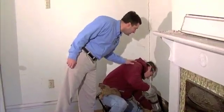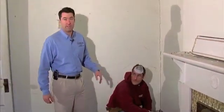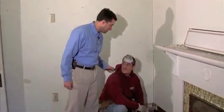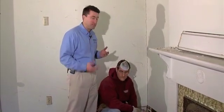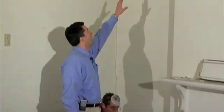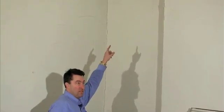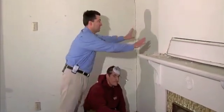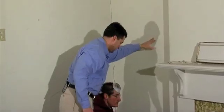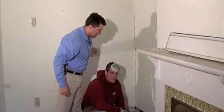There you go. I'm here with Jeff of Controlled Air, and what Jeff's doing right now is cutting the opening to get down to the first floor for the air return. That's going to go up through this wall and to the third floor, which is going to allow us to get that cold air return coming through this wall. So we've decided that the easiest way to do this is to fur this wall out, create a chase, and that's what Jeff's doing here, cutting through the floor.